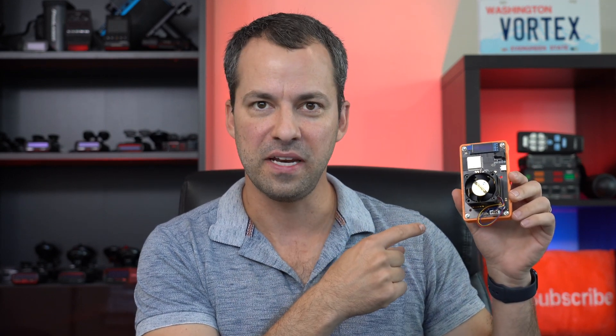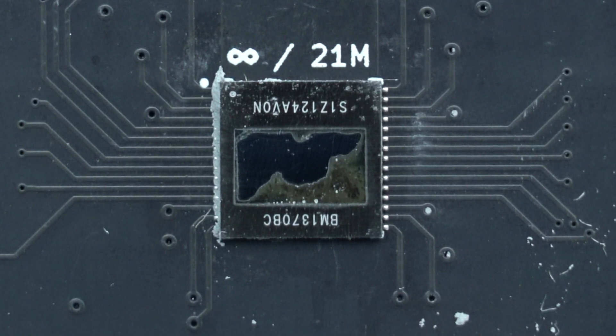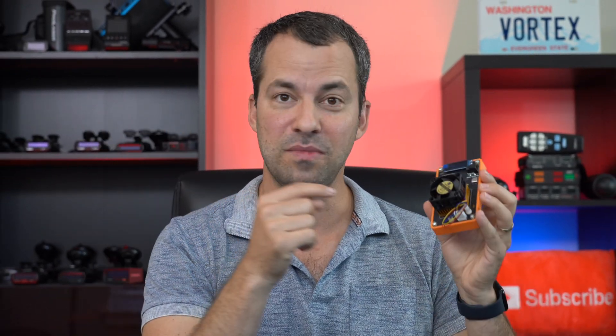At the heart of any one of these BitAxes, you've got the ASIC — the chip that's actually doing all of the hashing to function as a miner. Now that chip is going to get really hot. To help transfer that heat away and keep the chip cool, you've got a heatsink that connects to the ASIC and then a fan that helps keep the heatsink cool too. In between the heatsink and the ASIC, you've got some thermal paste. It helps to better connect the two and seal any gaps to allow heat to transfer from the ASIC to the heatsink, dissipating the heat and keeping that ASIC and your home miner that much cooler.